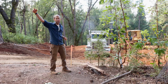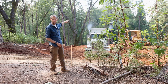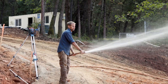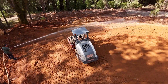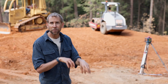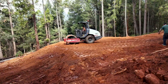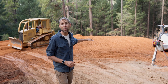We have a dump truck right now bringing in new fill from behind the building — we're going to raise the pad up two more feet. We've had two lifts so far and this is our final lift. The dump truck will dump the fill, then our bulldozer will spread it out thin enough to compact it with our sheep's foot compactor. We need around 15 percent moisture in the soil so that it compacts well, so we use this hose to spray down the pad for each layer. The sheep's foot gets its name because it looks like the hooves of sheep, and it also has a vibrator in it so the whole wheel shakes as we roll it back and forth — that creates the compaction we need to build up each layer as we bring in fill.